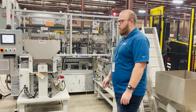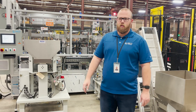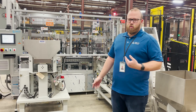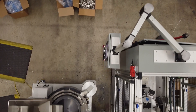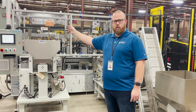Our primary electrical enclosure and the primary brain of this system is an Allen Bradley Rockwell Automation PLC. It can be either a standard ControlLogix or a GuardLogix PLC. In this case we have a 10-inch Allen Bradley HMI mounted on one of their swing arms that allows the operator to swing the HMI to the other side of the machine.